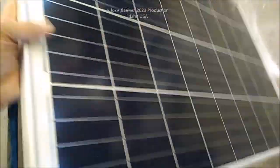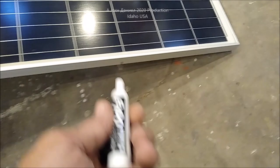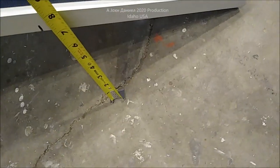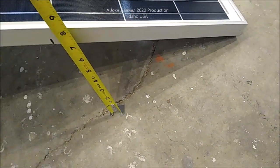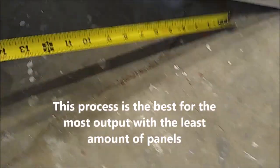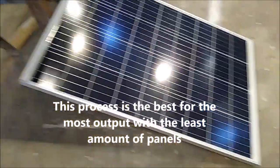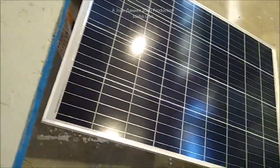I'll set the panel out here on this sawhorse at an angle and grab a tape measure. Say I've got a foot out — mark my panel or mark a board. A foot out, then I'll measure down, and if I'm trying to end up with whatever the box showed me but my roof is already at an angle, I measure the difference — that's how much I need to raise the panel up to match my perfect solar angle. I hope that made a lot of sense.